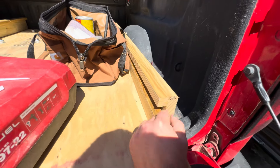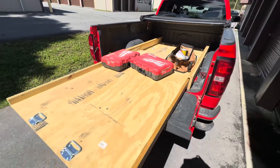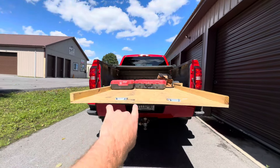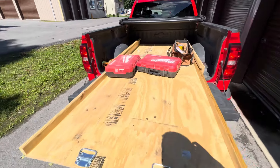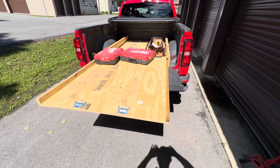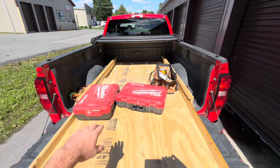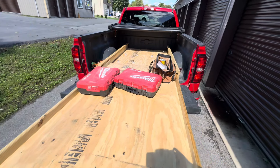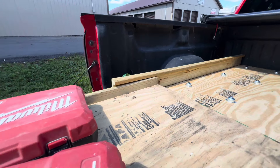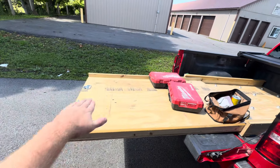You put this little one inch lip, and then this piece just fits inside this channel. The channel did cut a little bit wider than I wanted, because these plywood boards bow like this — that's not exactly what I was going for, but they were the nicest piece of plywood I could find at Lowe's. If you can find straighter boards, you can get a more precise fit. You've got to have room to allow it to move, but once you get it pulled out, that's what stops it from coming all the way out, so you really want it as tight as possible.